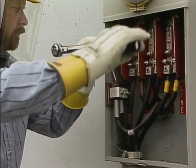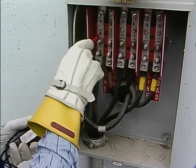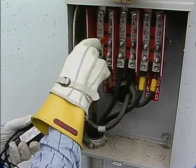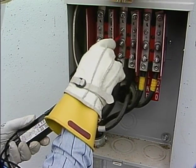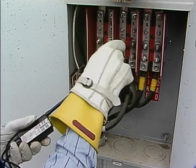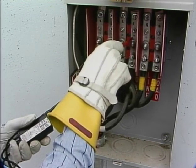socket base. When he checks the voltage between the line side and the load side of the phase on the socket base to neutral, he now has normal phase to ground voltage. Just to make sure that there are no shorts involving phase A inside the socket base, he checks the line and load terminations of B and C on the socket base to neutral. They read 0.